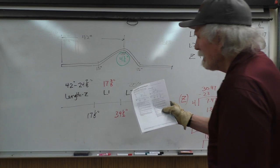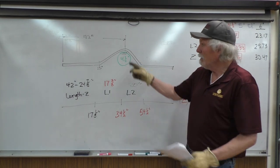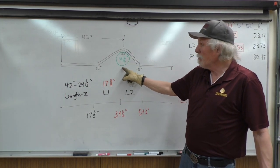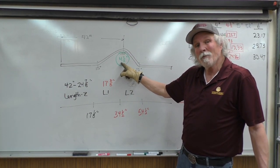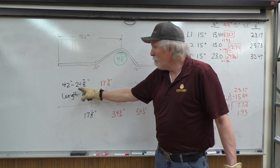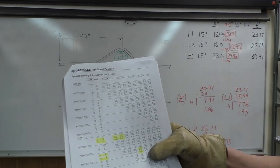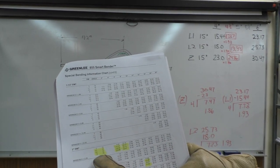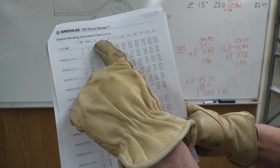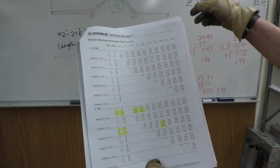When I'm doing the calculations for this, I'm going to the center of the 3-bend saddle at 42 inches from the coupling or connector or whatever to the center of the obstruction. And we're going over a 4.5-inch obstruction. So the first mark is length minus Z, 42 minus the value that we figure out. But what we find out is when we look at the manual, we're seeing the values for obstructions of 2 inches, 4 inches, 6 inches, 8 inches, 10, etc., but it doesn't show 4.5.